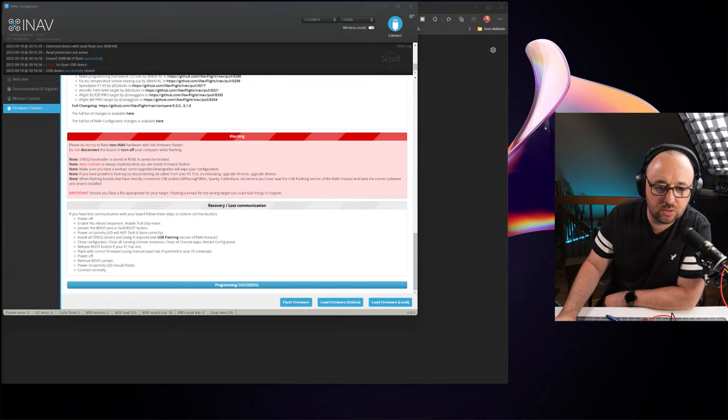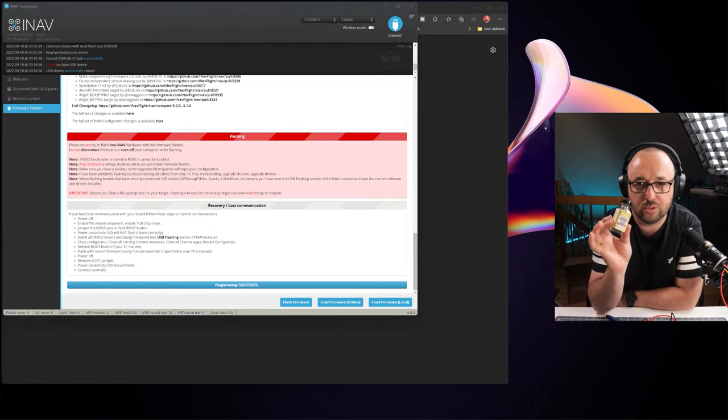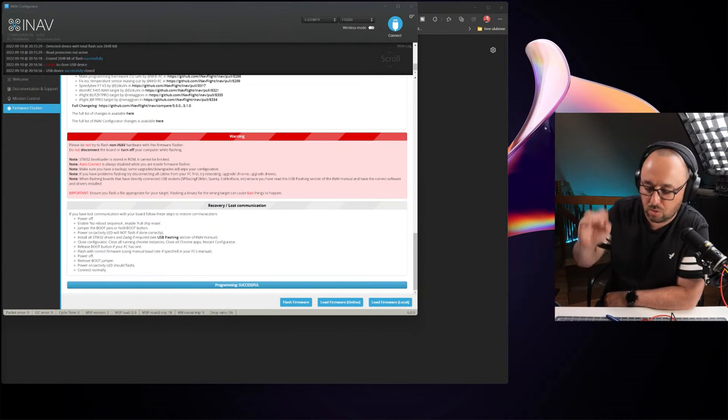There was a question from Piotr Malinowski. Can the coating process be reversed? This stuff, you just solder through it. The MG Chemicals silicone conformal coating, you just solder through it. If you want to solder, you just put the soldering iron on the joint and heat makes this thing go away. So absolutely not a problem, and it's not blocking absolutely anything.